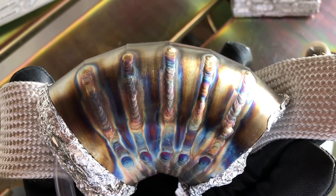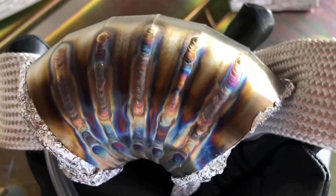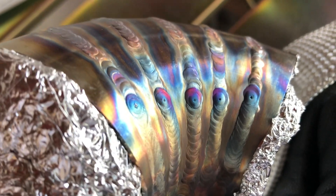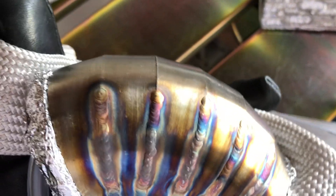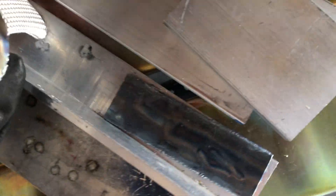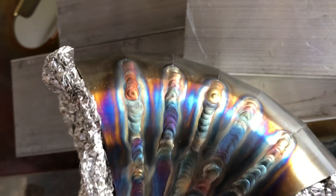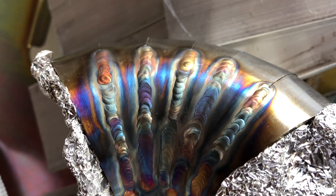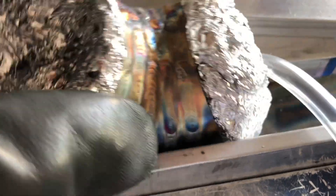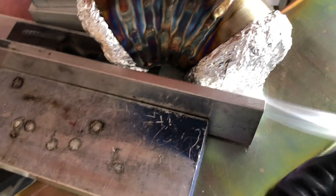More welding — you can see right here that I've made some headway with uniformity and with feeding the filler rod. It's still really hot, that's why I'm holding it with the TIG finger. I still have a little ways to go. I'm satisfied with how things are working out. Some areas look a little cold but I just need to get on the pedal a bit more. I couldn't get comfortable with position on these welds. Right under there is where I had one of the gaps from earlier — just trying to fill everything in.